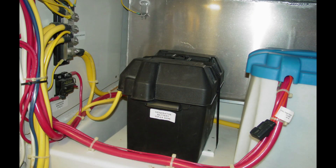For DC system inspections, we're going to start with battery installations. Batteries are the heart of your DC system. Section E10 of the American Boat and Yacht Council's Standards and Technical Information Reports for Small Craft covers battery installation requirements in great detail. Today we'll touch on the basics and the problems I commonly see while surveying. The basic requirements are the same for each of the more common battery types: wet cell, gel cell, and AGM — the standards are pretty much the same across the board for these.